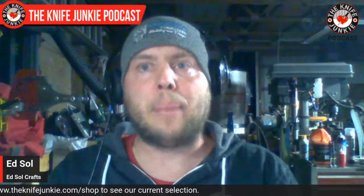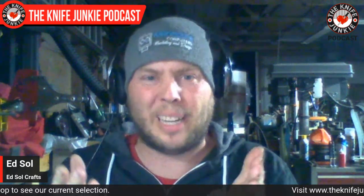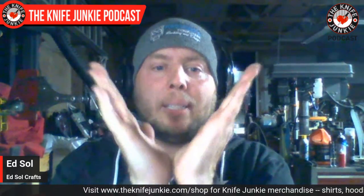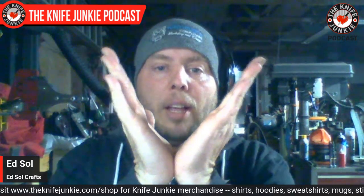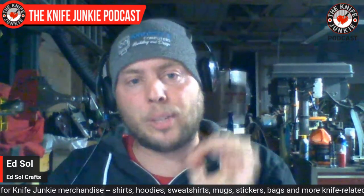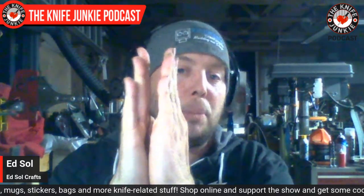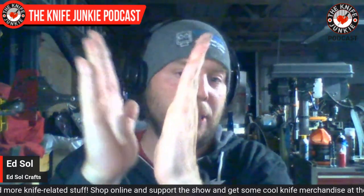Yes. Going back to sliceability, which has been my focus — I like very thin, very agile blades where there's less friction. The more you get it thinner, the less friction there is when you're slicing through things. So I try to make my blades literally as thin as I can close to the bottom, and then about halfway up it'll flare out a little bit to give you the resistance you need for food release. But as close to the edge as you can, you want it laser thin. That's what sets my knives apart — I like steels with very fine grain structures that are going to hold a thinner, sharper edge longer.